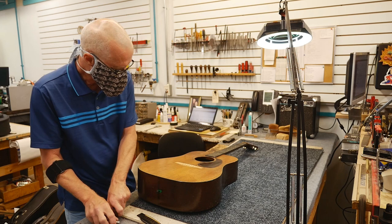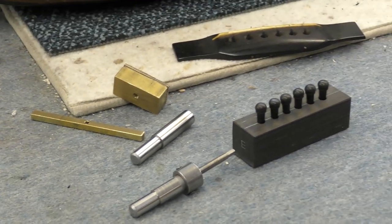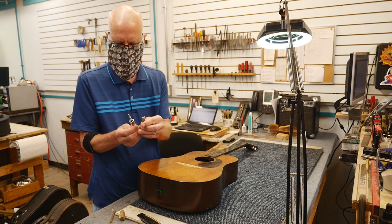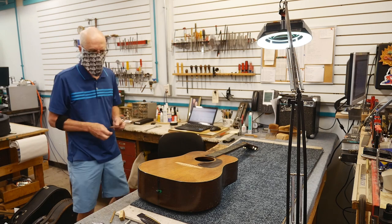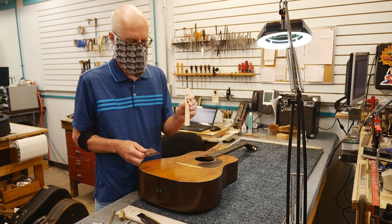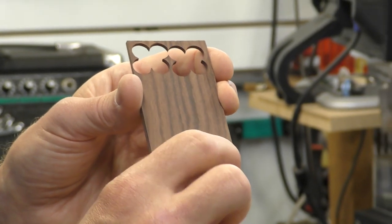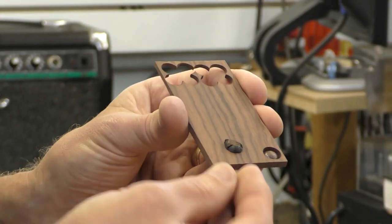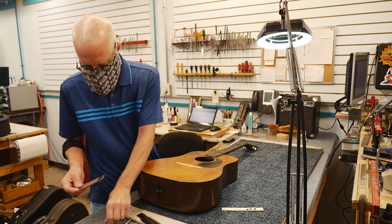I'm going to use a couple of really handy tools from StewMac — the bridge plate saver. This allows me to cut a hole on the interior, which I can do from the outside of the guitar, that will accommodate a patch made with this patch cutter tool. This is the tool that creates the cavity to fit that patch. You make the patches out of any material you want — I want to make mine out of maple. This is a piece of maple that has already had a few patches cut out — you can see they're round patches. The patch has a dome on the top, and this tool will cut the cavity that accepts that domed patch.